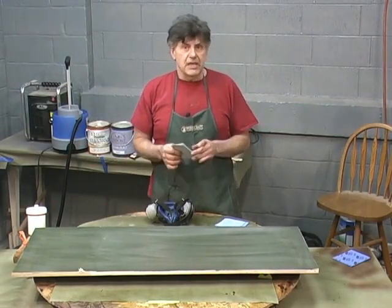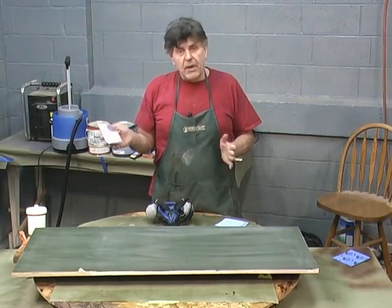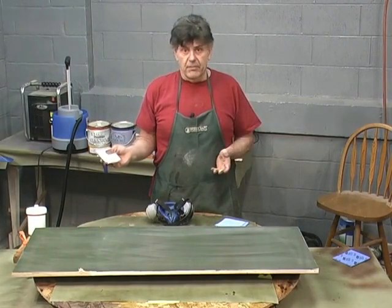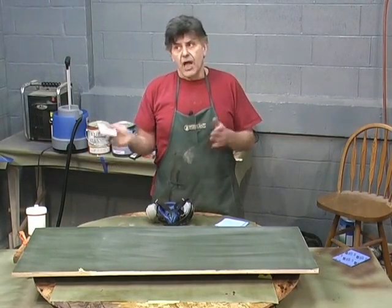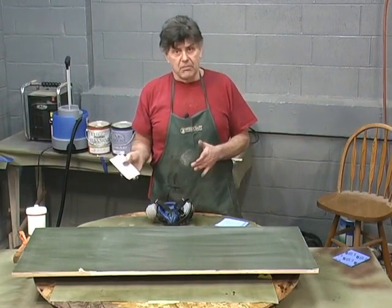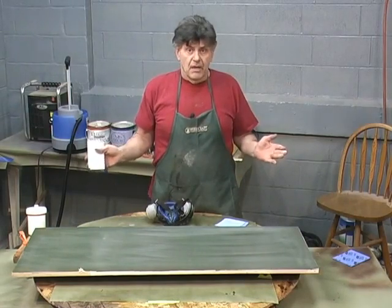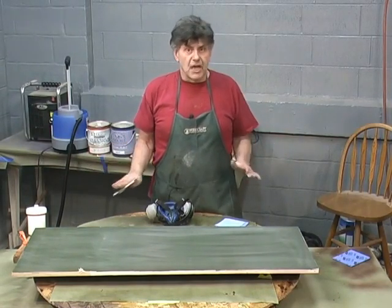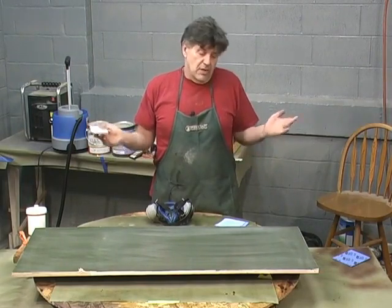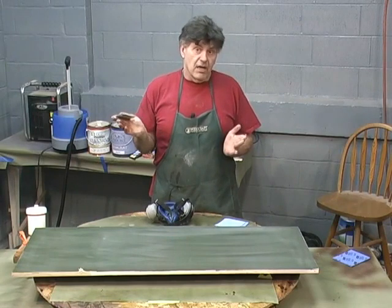It's not made to any decent standard. And if you buy good quality sandpaper, I've never seen the stearate give an issue. So a lot of these guys out on the forums are saying to use the silicon carbide, which is the black stuff. Problem with that is it loads up, because you're sanding something that's not totally hard at the moment. It loads up and you just waste a lot of sandpaper. Again, I've never had an issue.